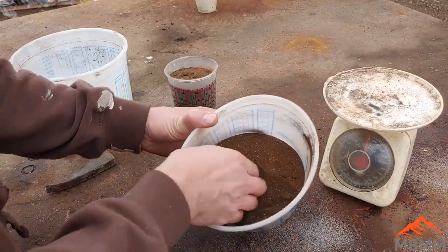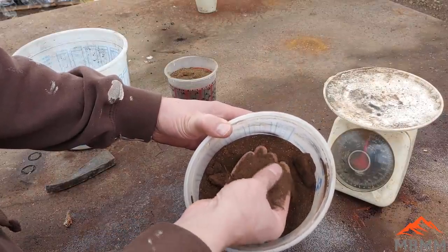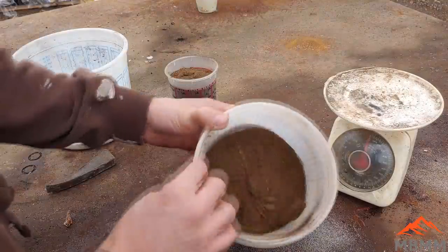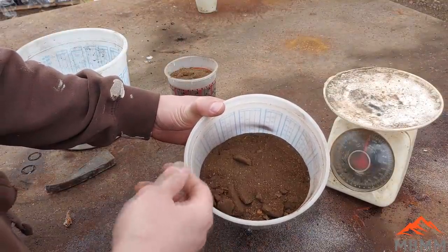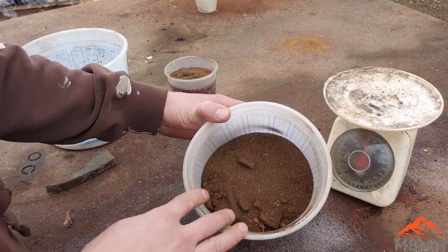And so today we're going to be working with these concentrates. These are off one of our shaker tables. This is a lot of sulfides in here. We got iron, pyrite, pyrrhotite, a little bit of chalcopyrite. But this is the stuff that on some of my other videos previously, I've panned the gold out and sucked it out with a snuffer bottle and direct cupelled it. And this is all the stuff that was left over. It's got a little bit of free gold in it.